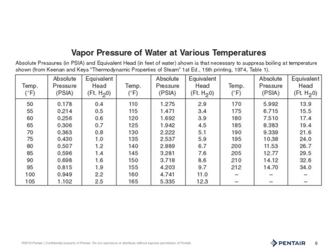to the impeller. Looking at this chart, you will see that the less atmospheric pressure, the lower the temperature that water needs to boil at. In addition, there is a real low pressure zone in the water system. Yes, you guessed it, the eye of the impeller.